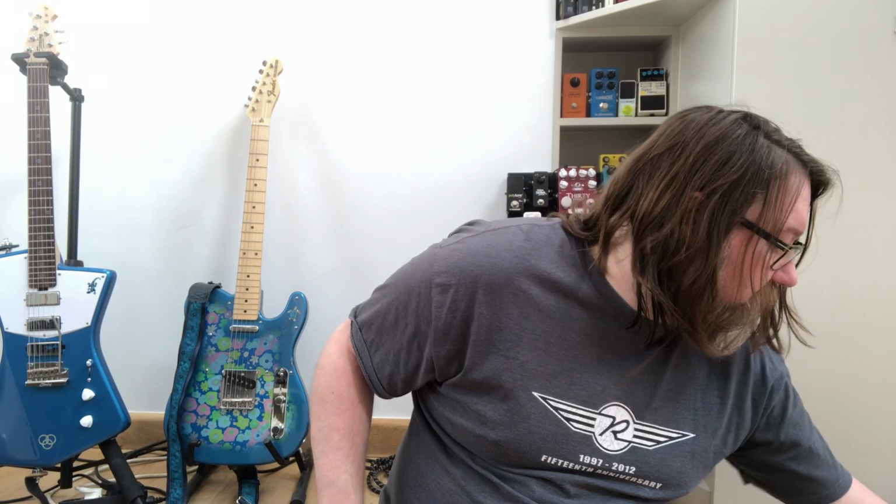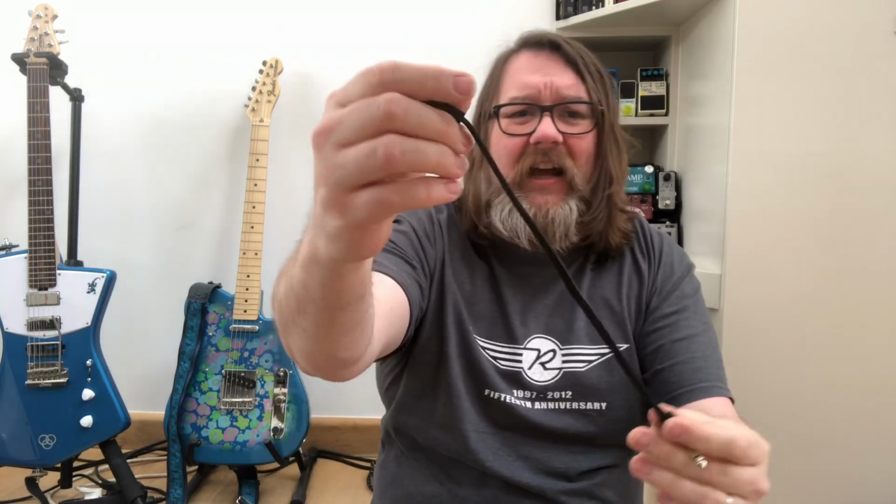that doesn't mean that your pedals have to be put on the board in the same order. What I do when I'm putting pedals on a board, if you're using decent cable, and honestly, in my view, most cable is fairly decent now. These EBS flat cables, really good. EBS is an excellent company, makes wonderful effects, one of the best bass compressors out there. For example, I find these very reliable, don't find any particular tone issues going on with this. I'm using a wireless anyway, so it begins with a buffer. So you're not getting the load of the capacitance of the cable fed into this.